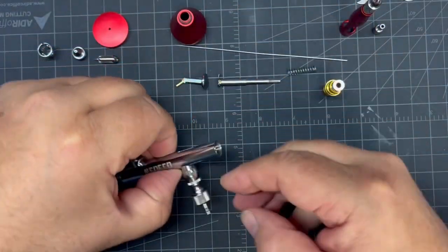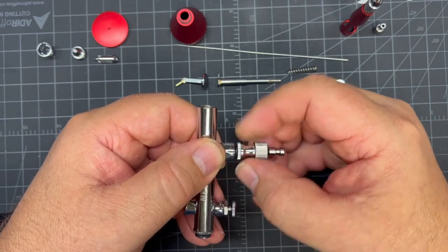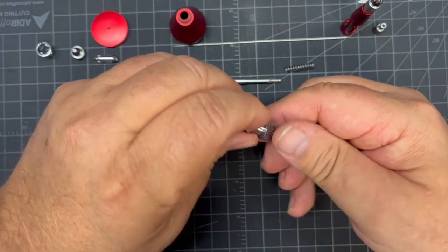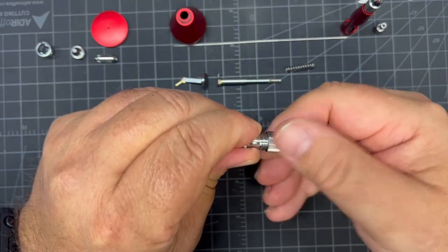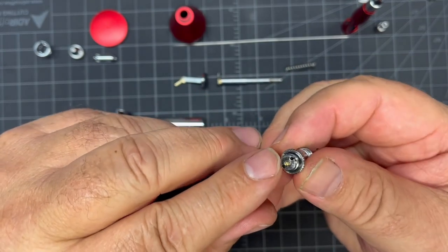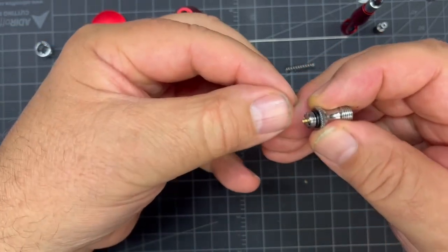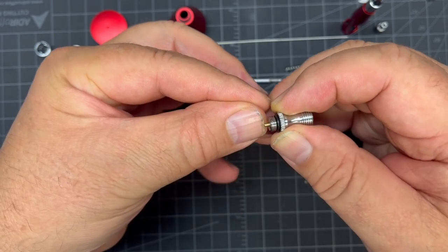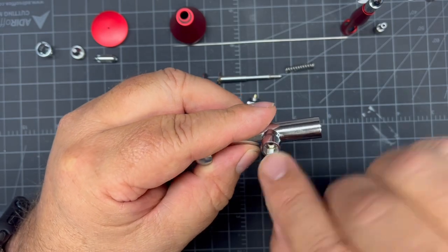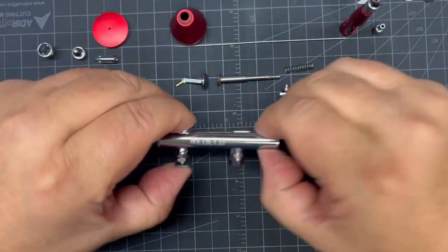Now I'm going to pull the trigger out — there's a little brass piece on a pivot hinge. When you pull the trigger back it pushes the rod back; when you push it down it opens the air valve. The air valve has a gasket, and this kit comes with a complete set of replacement gaskets. I'll take it off to show how it works. It's the same needle-and-seat setup as a Schrader valve on bicycle or car tires. When you push the trigger down, that brass piece opens the valve, lets air flow in through two holes, fills the chamber, and sends it down the line.